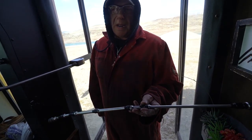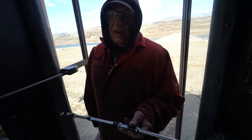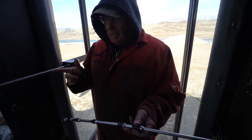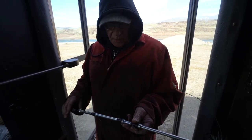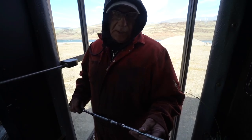If you put the plug in by hand, you won't strip it. But if you put it in with a ratchet or a gun or anything, chances are you'll strip the plug on the back of the thing — and then you don't even want to go there. Put it in by hand, get it tight, and then torque it. That's the trick.